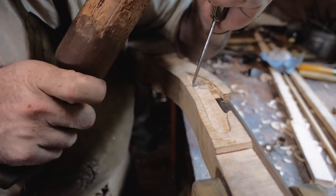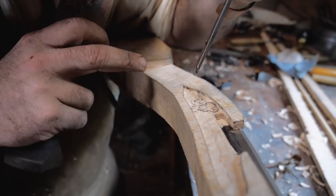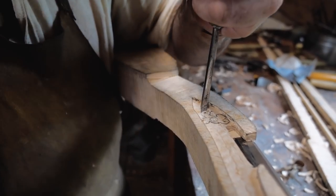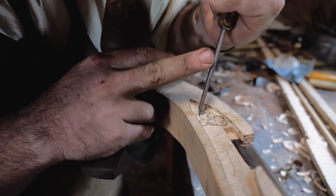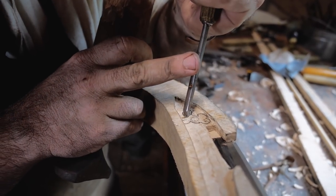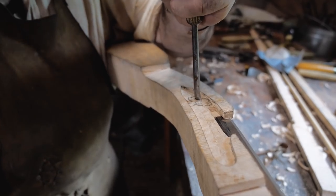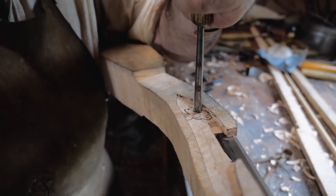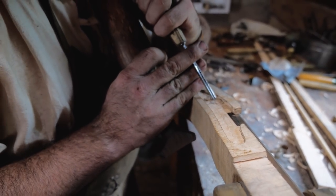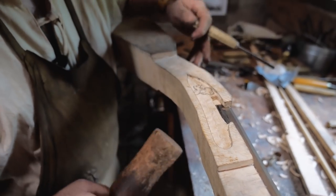Be careful tapping along the bottom there because you don't have much wood underneath your chisel and you can split out the bottom of your stock if you're not careful. Try to go as straight down as possible — you don't want to angle in too much, because then your bridle will still be hitting by the time you get to the bottom. Stay straight up and down as you can and work it all the way down. There's our bridle layout right there.